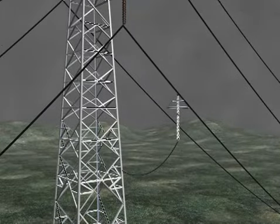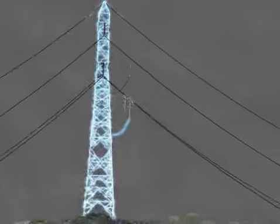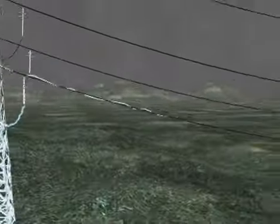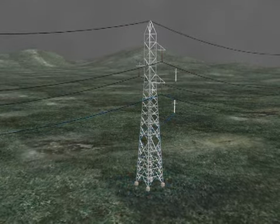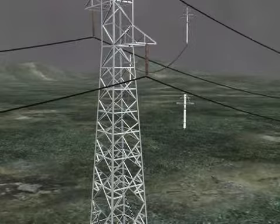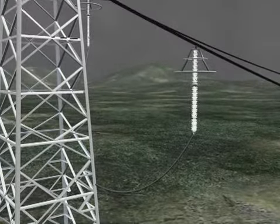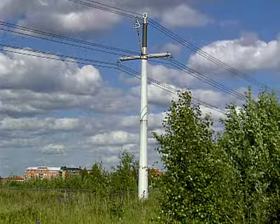Installing PEX Link parallel to the line insulators protects them from back flashovers. If the tower is struck by lightning, PEX Link shunts the overvoltages out on the phases. In nearby towers, PEX Link then shunts out the overvoltages from the phases to earth. Thus, PEX Link protects the line insulators from the lightning strike and the system from earth failure. This improves the reliability of the power line and ensures that the end customers receive a uniform, constant supply of energy without a power outage.